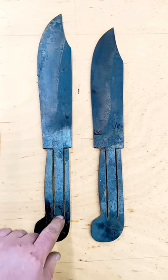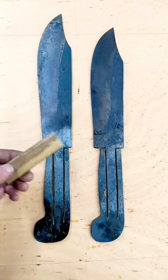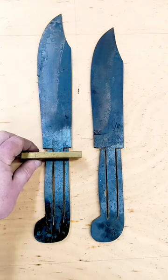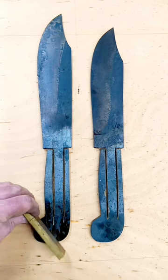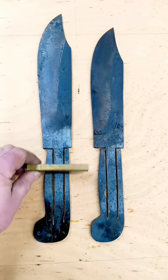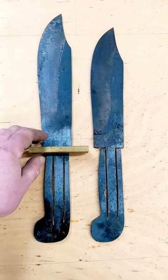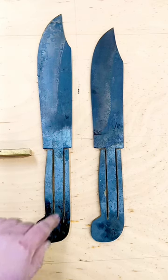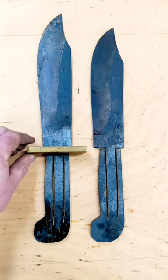I still need to cut the bottom of the tang off here. The reason for that is that when I go to make the blade guard and slot it to fit underneath the blade, the slot would be smaller than the end here — it couldn't fit on there, this would have to be considerably smaller, it wouldn't work right. So I cut the handle out and then re-weld everything back together again once the blade guard is attached and silver soldered.